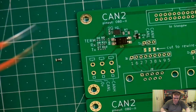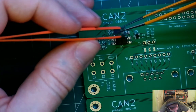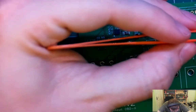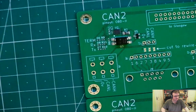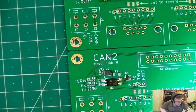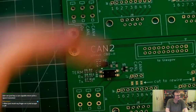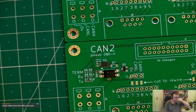I'm going to be really picky and try to get all the words the right way around. The solder paste on the pads for these resistors is kind of cupped — so when the reflow happens, it will just sort of grab the part. Another way to flip components is to rub your tweezers over the edge of them — kind of like pogs. Doesn't always work.